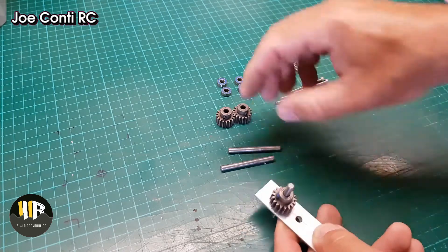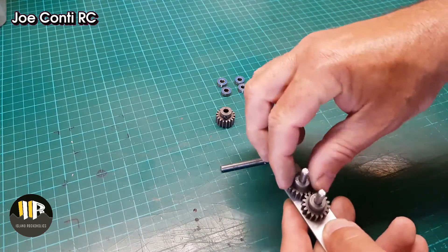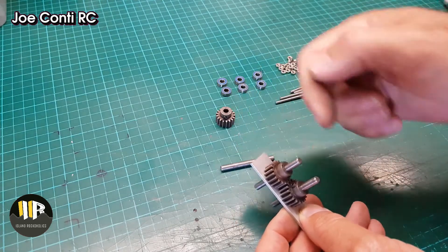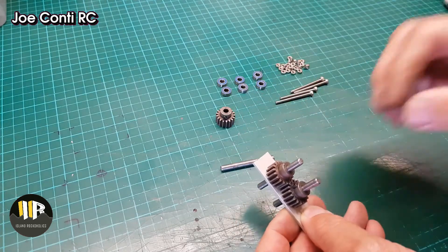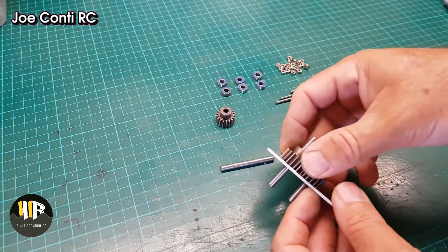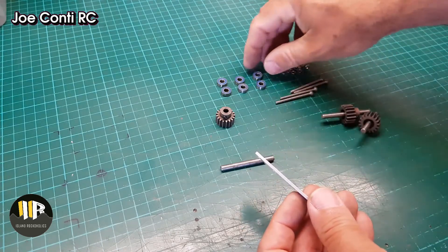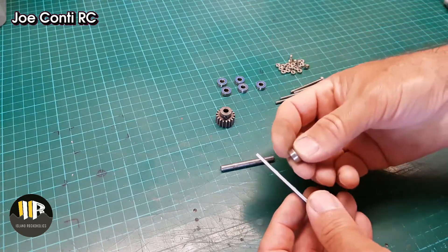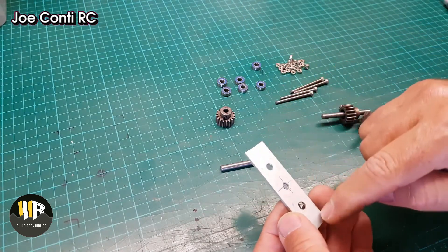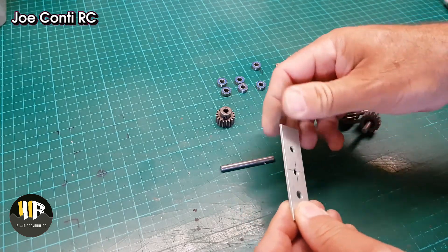I'm going to line up my gears like this and have all 4 drilled to align them with each other. I'll show you how I'm going to use the center too. Near each other will have wider 11mm holes for the bearings to fit in. When I've done that I will drill 4 holes here to screw them all together to keep it as one unit.